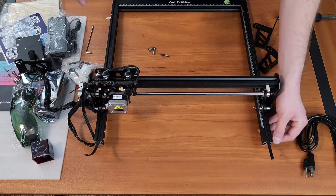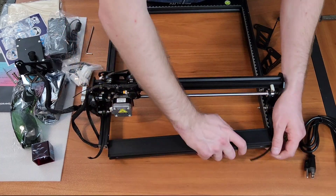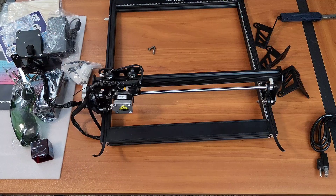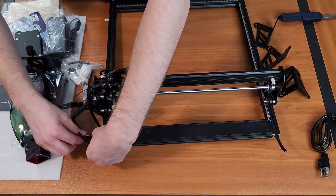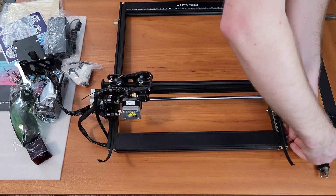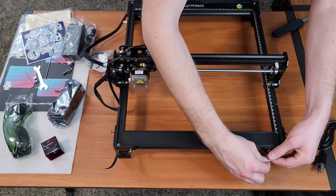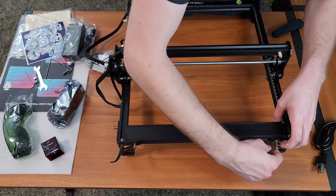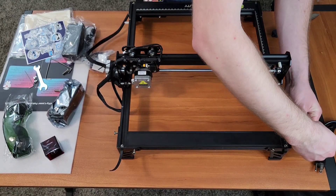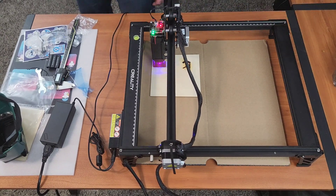Something to mention is that it doesn't have Air Assist. Air Assist uses a different nozzle on the laser that pushes compressed air — like from an air tank — out the nozzle to clean out where you are cutting. That's probably less necessary for engravings, but for cutting it's a must. I've actually been working on another video showing Air Assist specifically on this machine and how spending the extra $30 or so is 100% worth it.